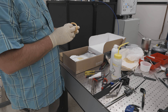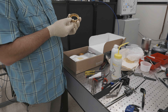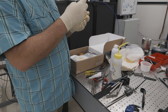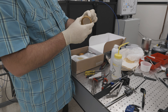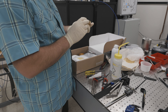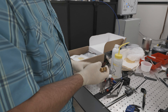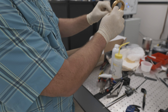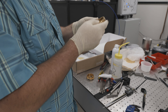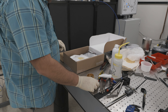We've got several of these old school filter holders. They're designed to take a 2-inch filter — you drop it in there, and then there's a ring that goes in and screws it down, and then the outside threads into the holder. We do have these screw holes here for heat sinking if we need them. This is the newer design. One thing you'll note is that there's an angle here — see how it's shallower here than here? We have all the windows tilted to avoid ghosting and multiple reflections off the windows, which makes machining these a little trickier. This one's pretty dirty — we're definitely going to need to clean it up.